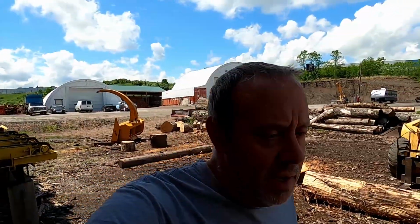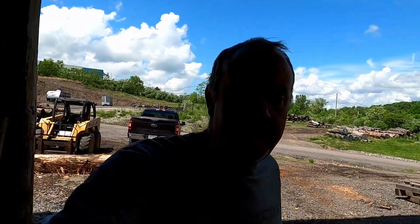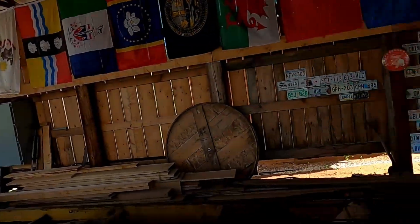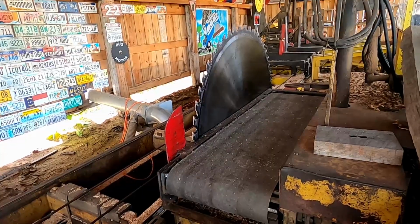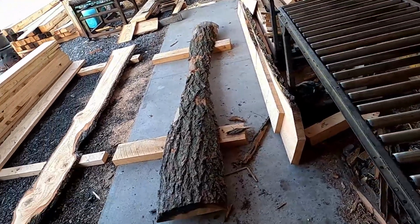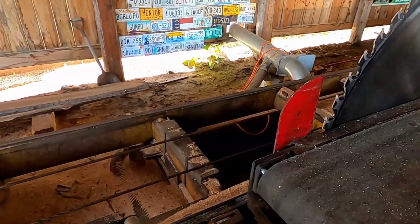And the buttons on the side over there run my tapers, which means I can actually taper the log. I've got two knees that run tapers on it. We do not have cant turn downs on this mill, and in order to get cant turn downs, I would have to give up a taper, and I don't want to do that. On Eddie's side of the mill, you can see the off-bearer's belt comes off and onto the roller tables, and that was that big piece of oak that you saw in the last video. And this is the board splitter.